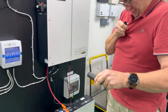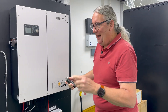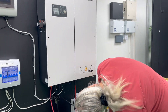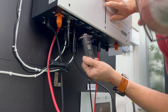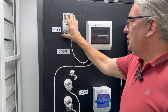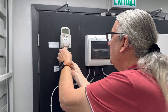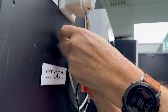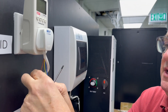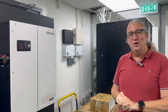I'll connect the negative here — we're connected, ready to rock and roll. I almost forgot the data logger — we have to have a data logger. The data logger goes in here; there are a couple of screws I won't put in right now. This is showing the AC coming in, and we run a CT coil. Some of the new units coming available later on will have a wireless CT option.